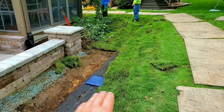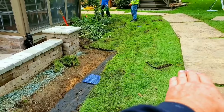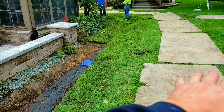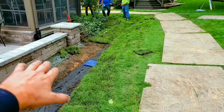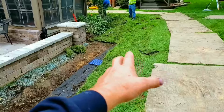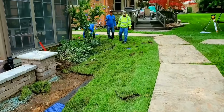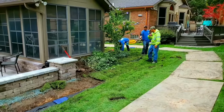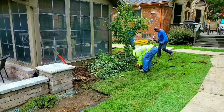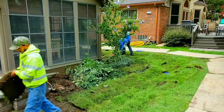Now the water just does this. When it's coming down and the ground's frozen and we all of a sudden have a thaw and the water's just really, really coming down, the sheet water is just going to go like this, literally. And every time it swooshes this way and that way, more is going inside the drain. It's captured, that's key. It's captured and the French drain is going to evacuate all that water. It's not going to get lost and become a problem.